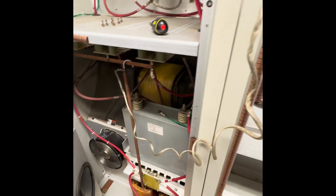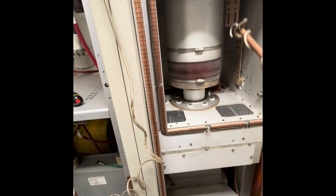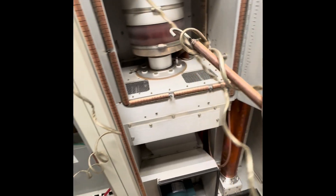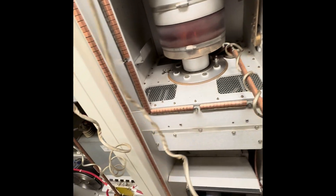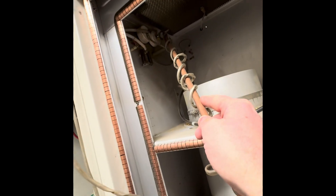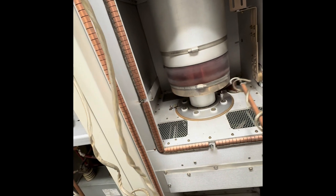Even though I know I have this stick over here, we're going to start grounding out. We're going to take this and touch it to the tube just to make sure the tube has no residual voltage on it. Nope, no voltage on the plate. Just for the hell of it, we're going to touch a little bit of everything to make sure, because you only get across this high voltage one time in your life.